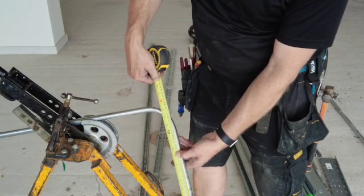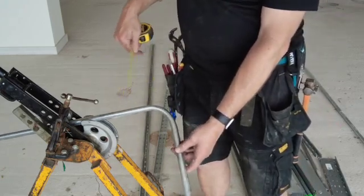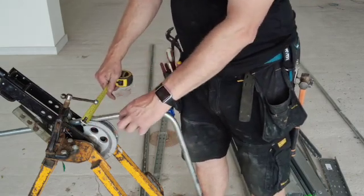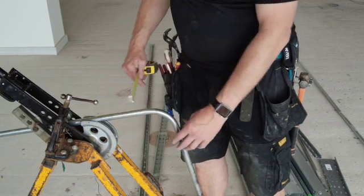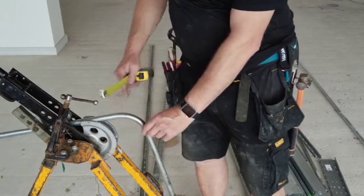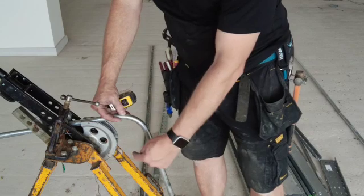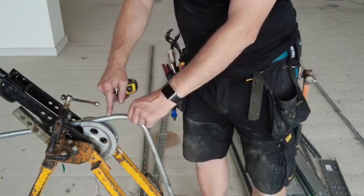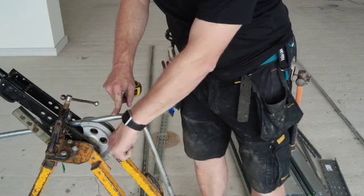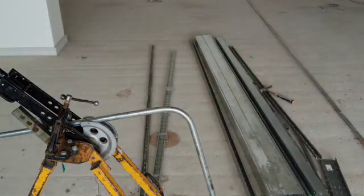All you've got to do is remember that when you are bending, it's the reverse side of the bend. So from the back of the bend, you come back 60mm. The original mark we had was there, and we came back 60mm because that was going to be the back of the bend. If we'd measured it the other way, we would have brought the line to there — that would have been the bend and the back of the bend. I hope that helps — please like, share and subscribe.